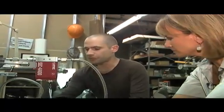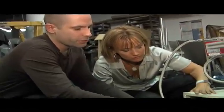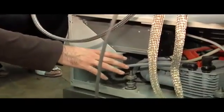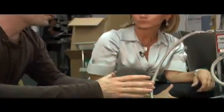Some technical notes: there are two different types of pumps on this pumping station. You have a rough pump and that's kind of what most people think of as a vacuum pump — that's the louder of the two. And then this pump up here is called a turbomolecular pump, and that's the more advanced of the two. That's what can take the system down to a very deep vacuum. It is almost like a jet turbine — you can hear it spinning up, it'll get higher and higher.